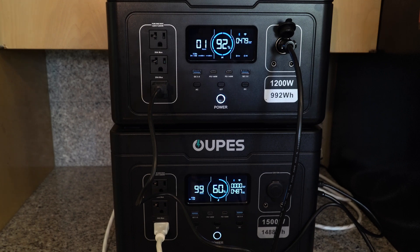I'm still not seeing much more than the 470 watts coming in — probably because I'm at 60% charged and might not be able to hit that full 800-watt input. I did see it flash above 500 watts, so it's definitely a little faster than slow charging, which topped out around 470 watts. It's bouncing up and down, but we're definitely charging — the battery percentage on the 1200 is going down a few percent while the 1500 is going up.